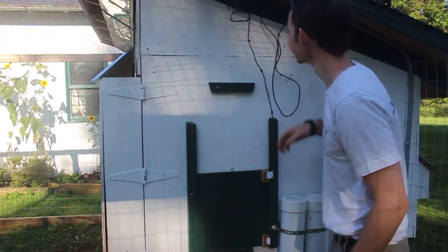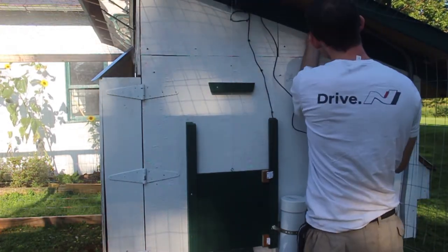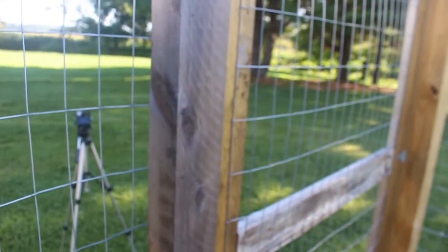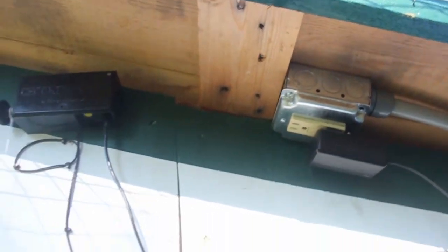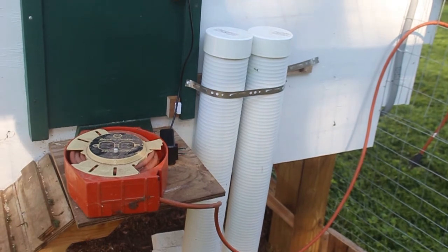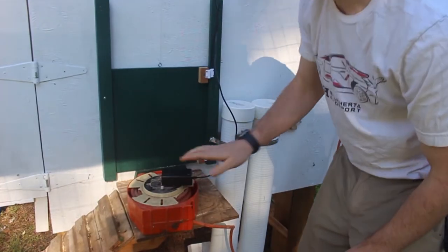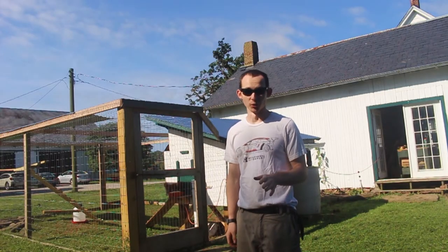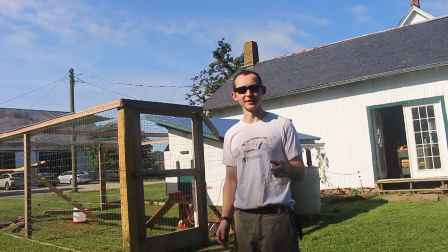Absolutely nothing. I think it's something to do with this power supply. Whenever I plug it into the Arduino, the light goes from constant to flashing and it makes this clicking noise. I ran an extension cord from inside to bypass the GFCI outlet out here that may be bad — same issue, this thing's flashing. So it's not my outlet. I just got off the phone with technical support, i.e. Brendan, who thinks the problem is not in the power supply itself but that the wires coming into the Arduino are somehow touching and shorted, so the power supply keeps resetting.